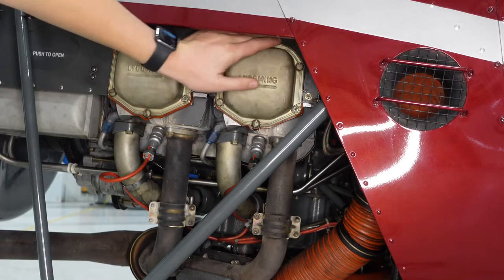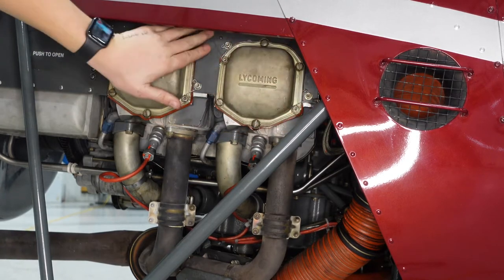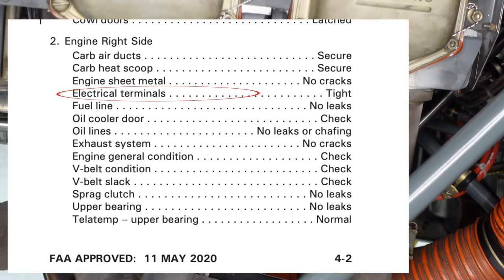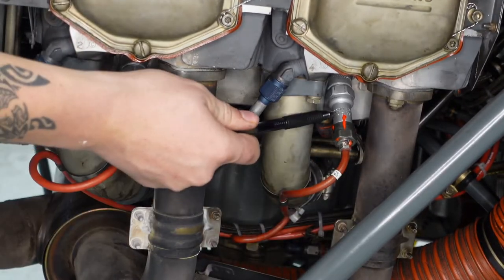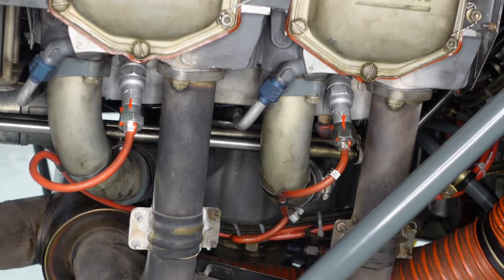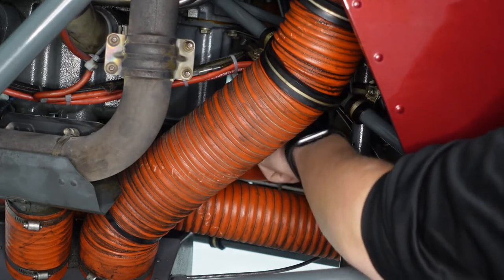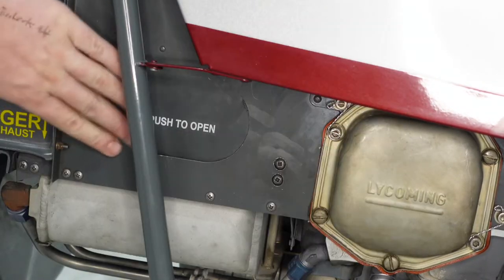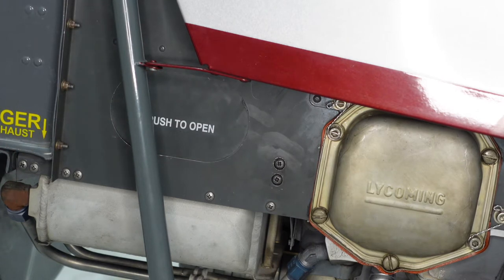Next we're checking the engine sheet metal, making sure there are no cracks. I like to check the cylinders and all that gray stuff above it. It gives me a good opportunity to touch the engine and feel for anything abnormal. Then the electrical terminals — these are the spark plugs. They have torque stripes on them, and I give them a really good twist to make sure they're not loose, then check the quality of the wire, making sure it's not frayed. Then the fuel line — the big thick orange line. And then the oil cooler door, which is like a radiator — it radiates warm oil heat. We make sure there are no mice, leaves, or bugs in there.